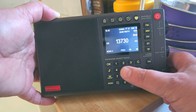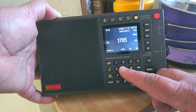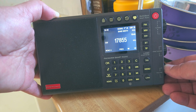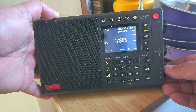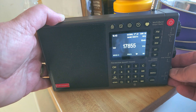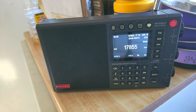Once again, birdies. It's almost as if when you're tuning a frequency — I'm going to go to Spain here — Spain is great, but the biggest problem is when you're tuning around, you've got to hope that whatever you're going to listen to doesn't fall on a birdie frequency. Sadly, a lot of the signals I was trying to tune were unfortunately mixed in with internal birdies from the receiver.